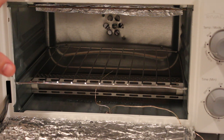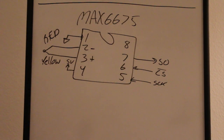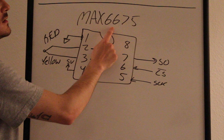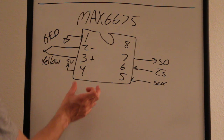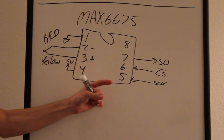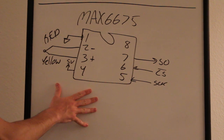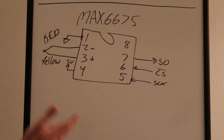So now let's take a closer look at the circuitry. Okay, so the first part of the circuit I'm going to talk about is the thermocouple amplification circuit. And this is all handled using the MAX6675 IC. This is a surface mount IC, so I have a little breakout board. I think it's a SOIC 8. I'll put a link in the description below to where I bought the chip and the little breakout board that I soldered it to. So this chip is pretty simple and straightforward to hook up, but I wanted to talk about it because there's a few things about it that are kind of gotchas, okay?